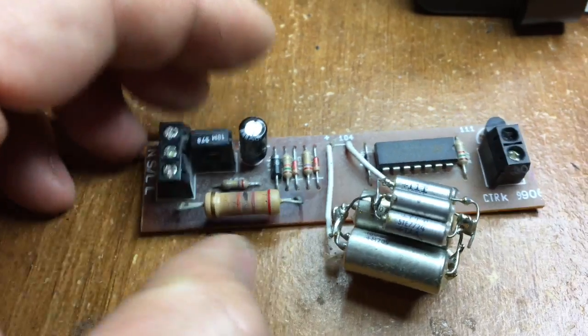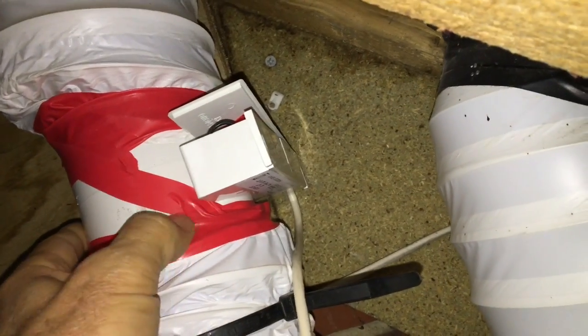That was enough to fix the unit. With those bigger capacitors the lid didn't fit, but it doesn't matter in this application because it's hidden well out of the way. It runs consistently now — the timer is set for about six minutes. Those capacitors are very old so the capacitance value has probably gone down compared to what's printed on them, but that's good enough. It's stopped going on and off and has given us a time period where it runs after the light has been switched off. Very simple fix — change the capacitors and your fan timer will start working again. Thanks for watching, bye.